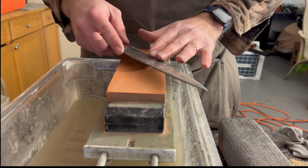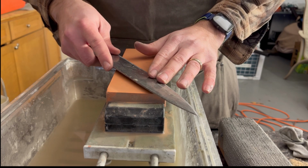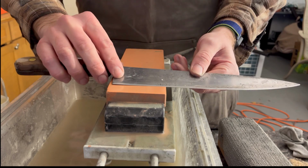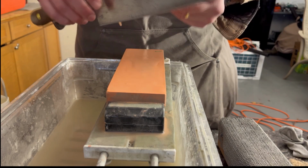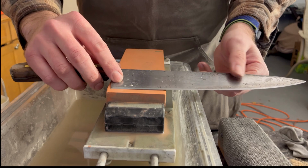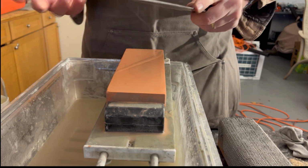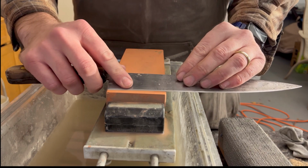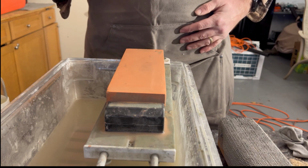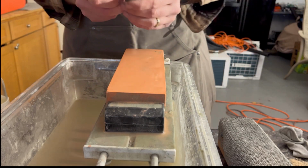When you sharpen a knife, for the most part, because the heel of the knife's always different, you're gonna want a nice 45-degree angle, maybe a little higher, because if you start sharpening knives this way, you're sharpening a lot wider piece of steel than if you're doing it this way. We will have to do it this way when you use the backhand, but unless you're ambidextrous, I recommend using just your dominant hand to do all the sharpening. I don't think it's even worth your time trying to do it left. I've gotten good at it, but I've reverted back to just using my dominant hand. I think the results are so much better, and it just feels better because everything's with your dominant hand. So unless you're ambidextrous, we'll be sharpening with a push, and then we'll be sharpening with a pull on the reverse side. So let's have at it.